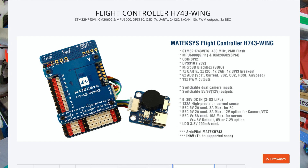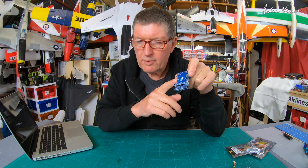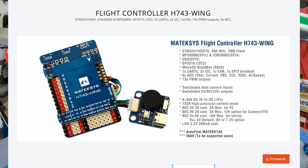The H743 uses the H743 processor, which gives more than twice the processing speed at 480 MHz. You get a choice of IMU or gyro-accelerometer units — there are two to choose from. The barometer has been changed to the more accurate DPS310 instead of the usual BMP280 that most other flight control boards use. It still uses the normal iNav OSD. For flashing ArduPilot to a flight control board you need at least one meg of flash memory — this has two megs, so plenty of space, and it only works on ArduPilot at the moment. Features include black box recording, seven UARTs, two I2Cs, one CAN, one SPI3 breakout, six analog-to-digital converters — that's VBAT, current, VBAT2, current 2, RSSI, and airspeed — and 13 PWM outputs.